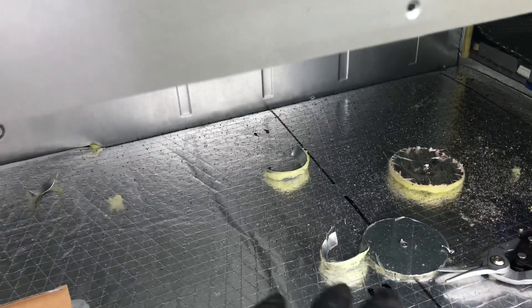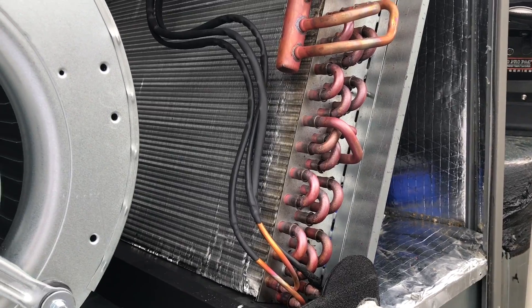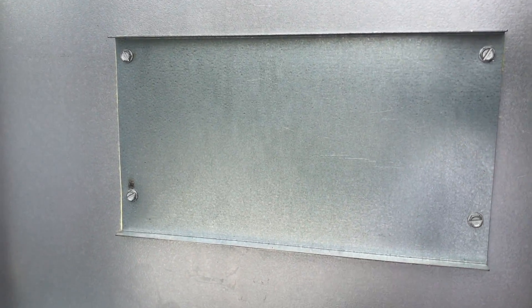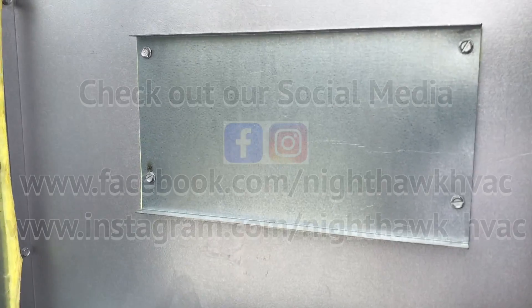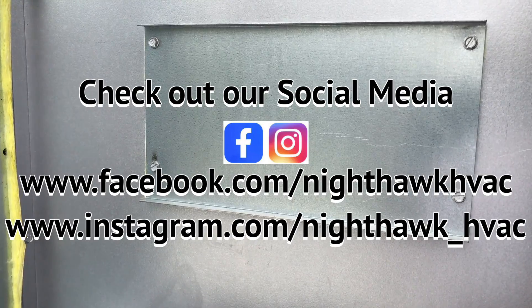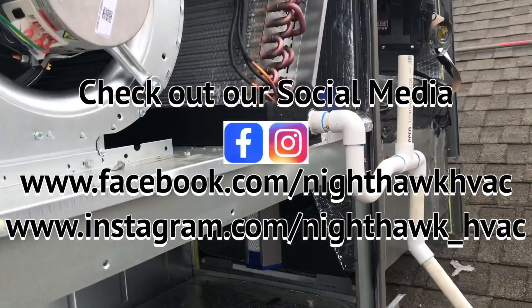I'm going to clean up all that mess. That's pretty much how you install an air scrubber on a Lennox package unit — the hard way of course. The easy way would be to put it in that electric heat strip panel instead, but now I know for next time. I also need to get a bigger hole saw for this one — most of them a 3.5-inch hole is fine, but this one I think needs a 5-inch hole. Anyway, thanks for watching — make sure you like and subscribe, hit that bell notification, comment and tell me what a horrible technician I am, and we'll see you on the next one!